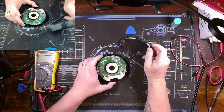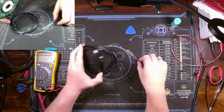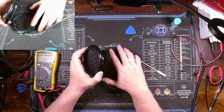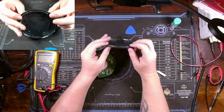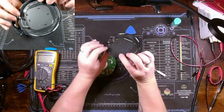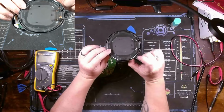Device cover now taken off. It took a bit of prying, and there's this elastic in there holding it in. Turn it upside down, insert as you saw through that quick, and then you're going to pry this part upwards, and that will pop this part down, if that makes sense. Because you've got these retaining tabs all around the side. I don't know if you can see them. There goes one, another. It's these retaining tabs that you're essentially prying loose. These two, that one.